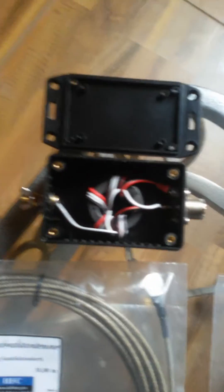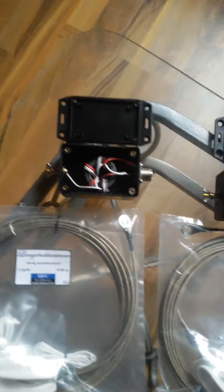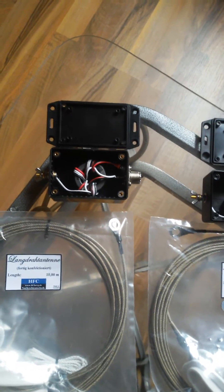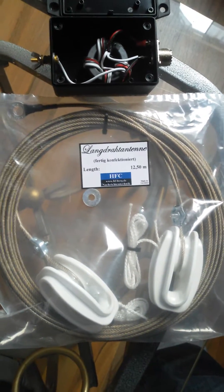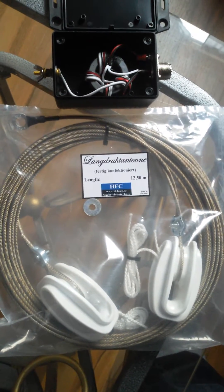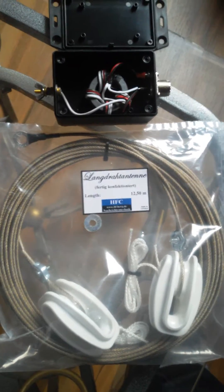Here's the inside of these baluns. Examining them closely, I really can't tell the difference between why one would be 200 watts and the other 100 watts. Maybe the ferrite ring is a little heavier or the composition is different, but just looking at it I can't tell if it has more wraps or not. It doesn't matter to me because I'm not going to transmit on these. Some people say baluns don't make a difference when receiving shortwave, but I disagree — I've tried this antenna without a balun and it doesn't work as well; the noise floor is a lot higher.